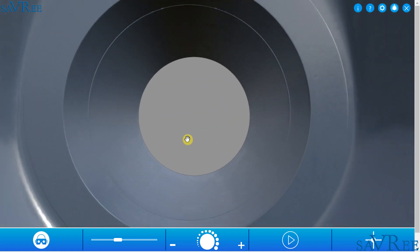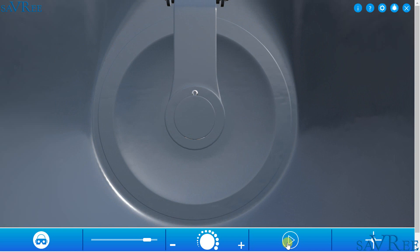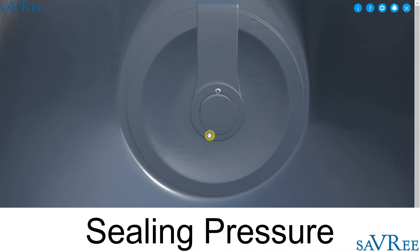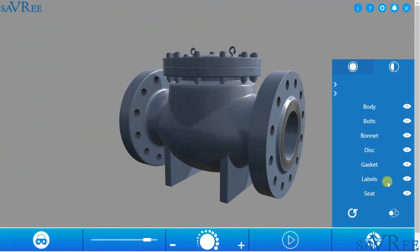However, let's now simulate if flow comes from the opposite direction. If the outlet pressure exceeds the inlet pressure, the check valve will close and the disc will be pressed against the seat — that's what we're seeing now. The pressure at which there is no indication of flow is known as the sealing pressure or seating pressure.